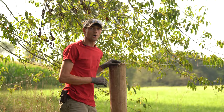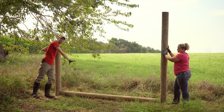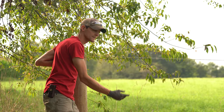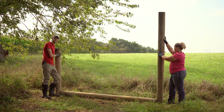Our distance for line posts is going to take its cue off of this vertical brace post. We want our H-bracing to be two times the height of the fence, so we have roughly a four-foot finish here. We're going to use a full eight-foot post to be our horizontal. When you're placing your vertical post, you want to keep that post tighter rather than farther away, because we can always trim this horizontal post to keep it tight, but we can't stretch it if we have too much of a gap on the other end. So make sure you line up your horizontal post in a way that it'll be nice and snug for this H-brace.